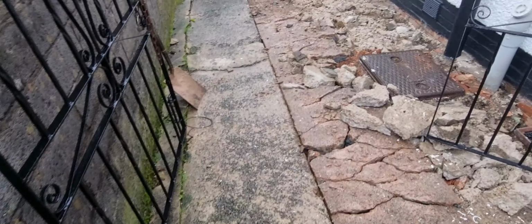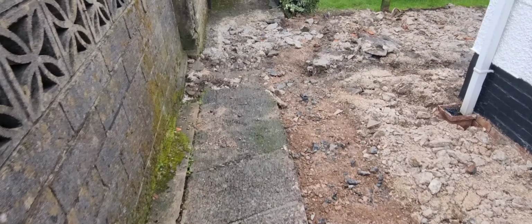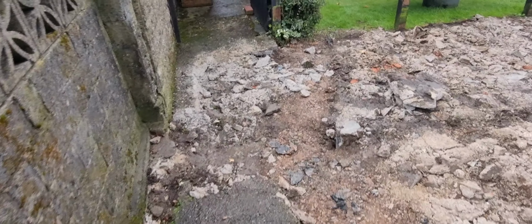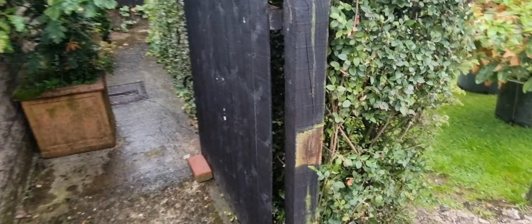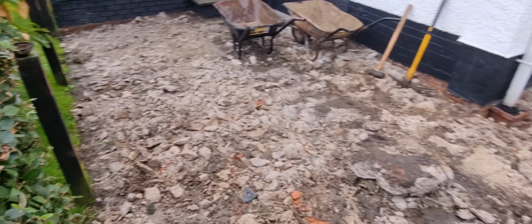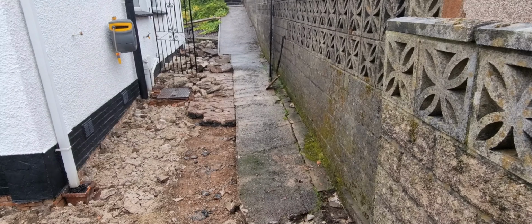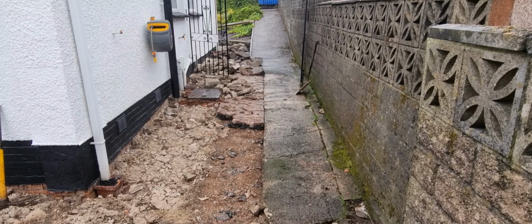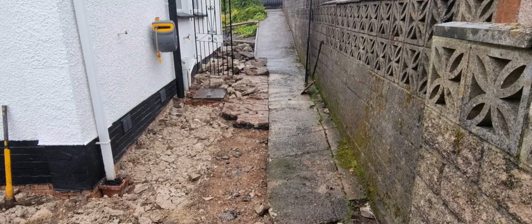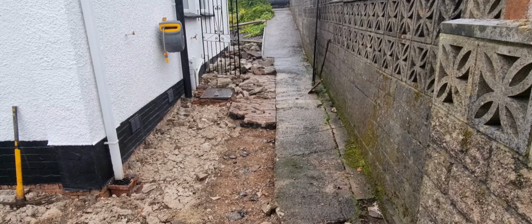So if you've got that, if you lay your paving on top of that, then what you'll find is any further separation of the concrete will come through into your paving and you'll get the cracks on your paving. So you've got to take it up, put a new base in, and start again. So very key to do it the right way. So we'll crack on, and we'll show you Brad or Frey doing a bit of the jackhammering. So let's get it out of the van, and we'll show you in a minute.